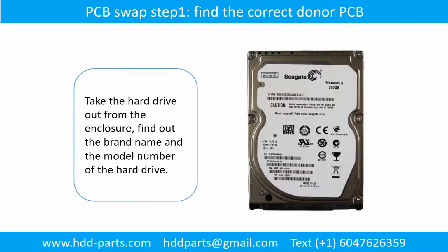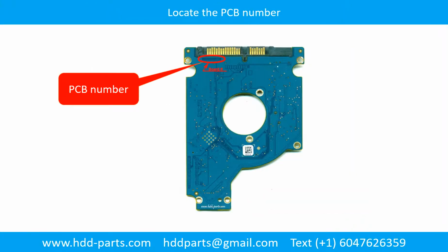Problem 2. PCB board swap. Step 1. Take the hard drive out from the enclosure. Find out the brand name of the hard drive and the model number of the hard drive. Locate the PCB board number. Different brand name, different model number, different PCB board. The PCB board number and the location are different.